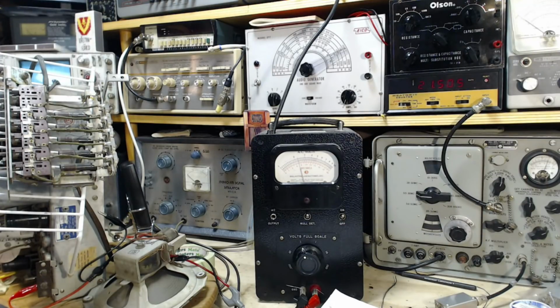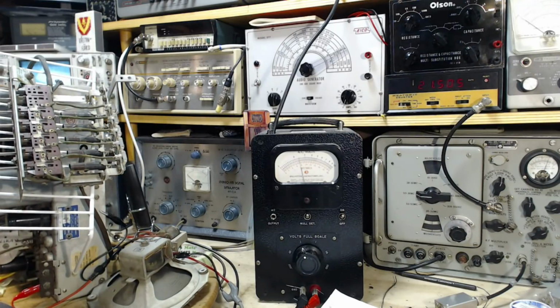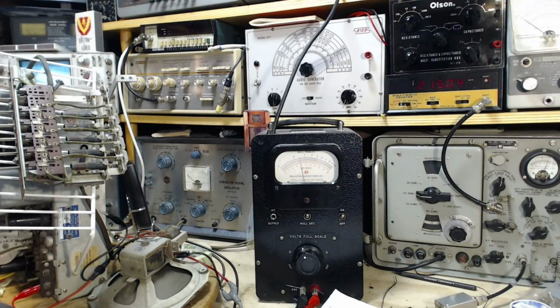Center screw. Okay, first screwdriver sensitivity. Doesn't seem to be any. Here we go. Hold still. Turntable. Watching the meter now. Don't like what's happening here. So I've loosened that screw right off. I'm going to tighten her right up. Just going down, down, down. Doesn't want any additional capacitance. Now, so I've tightened it down.